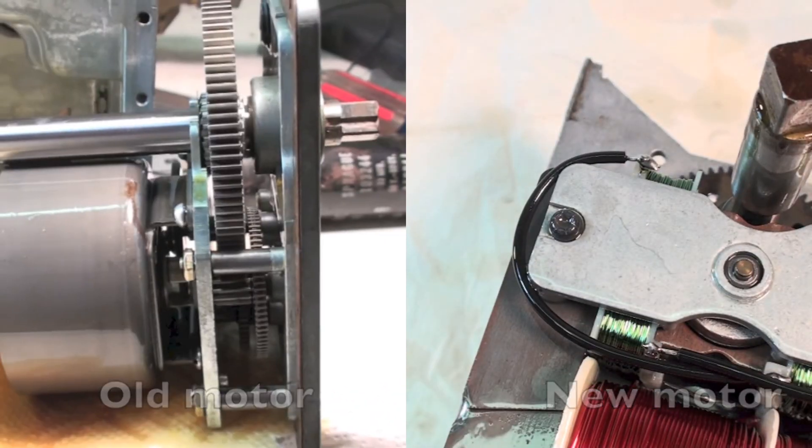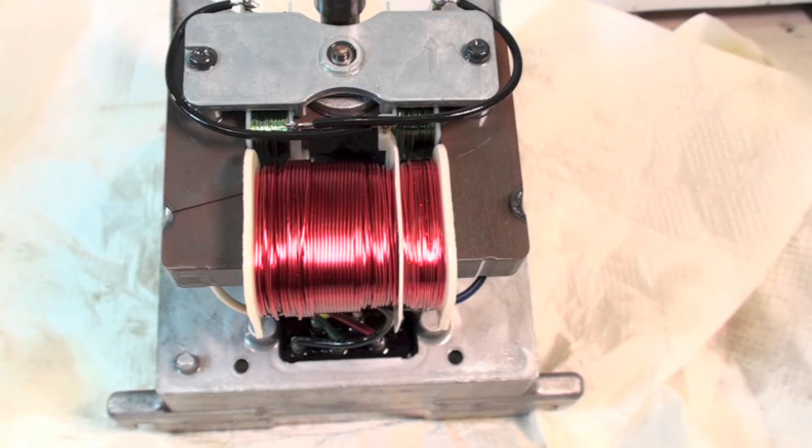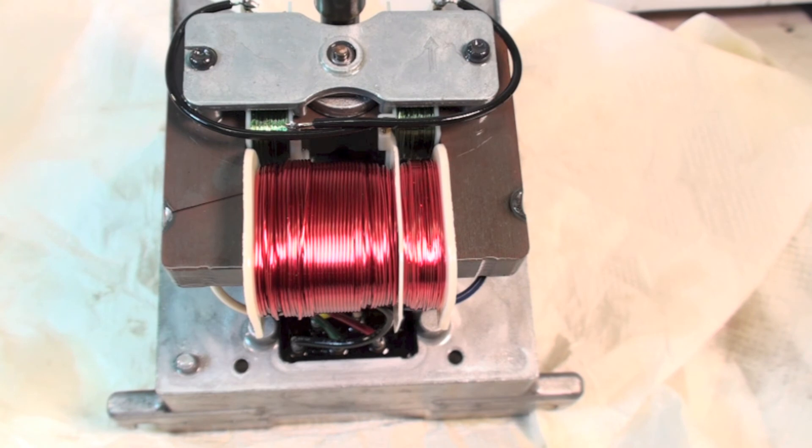The motor is considerably different. The other one had a three-wire motor, which is essentially two windings to provide forward and reverse motion. This other motor is a little bit different - it's got four windings on it. There are two up there that appear to be maybe some kind of feedback windings or something like that. The bottom ones are probably driving the motor. And that's a comparison of a very old motor to the newer style motor that is still used today.